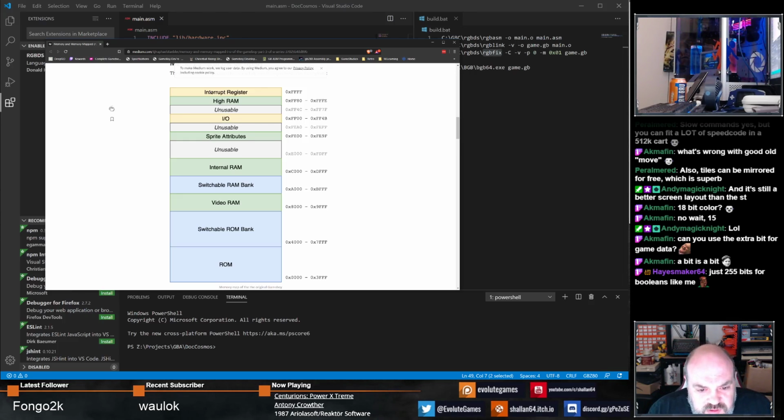So you have technically 64 kilobytes of addressable ROM and RAM. Now, if it's ROM, it's always ROM. If it's RAM, it's always RAM. That can't be changed. But what you can do is you can bank some things in. So what that means is,